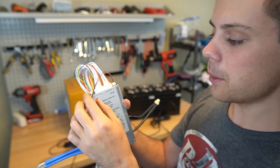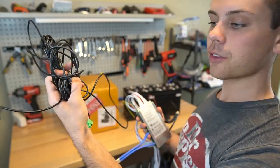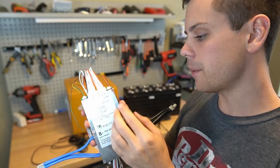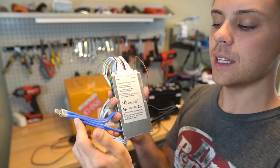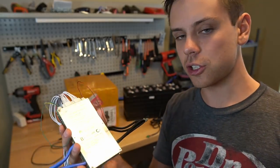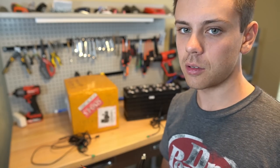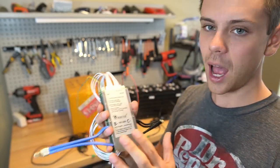We have a temperature sensor and a harness wiring diagram for connecting two temp sensors. There are 17 wires because this is a 16 cell BMS. There's also an additional wire — possibly for external power supply or regulated output. This BMS came with a strange little tab which I'm going to replace with my own terminal lug. The main negative goes out to our loads. Solar charge controllers I connect directly to the battery with lithium iron phosphate — it's safe to do. For loads, low voltage disconnect, and individual cell monitoring, you absolutely need a BMS.